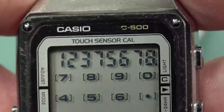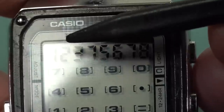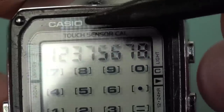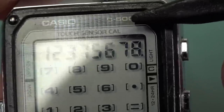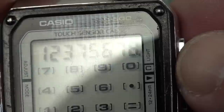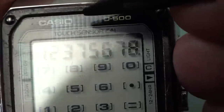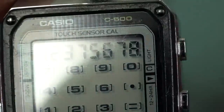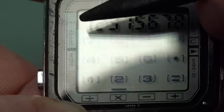And it really is difficult to see the embedded traces on this. If I get the light shining on this at just the right angle, you'll start to see it. There you go — you can see the grids in there. And that strip going across there is probably some zebra strip or something contacting that top glass surface. You can count the number: 1, 2, 3, 4, 5, 6, 7, 8, 9, 10, 11, 12, 13, 14, 15, 16. That makes sense. You can see the pattern, and you can see them coming off the side and going around like that.